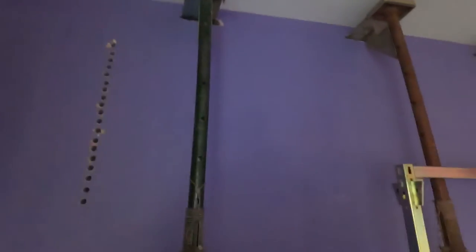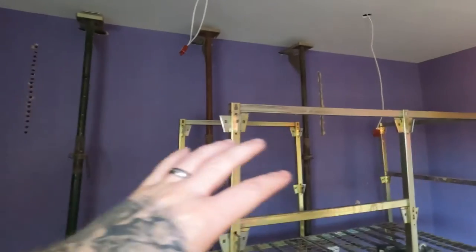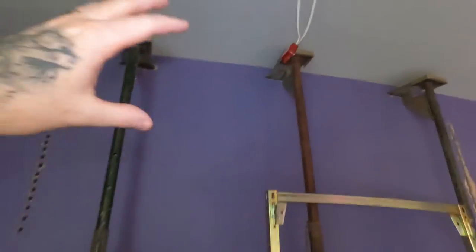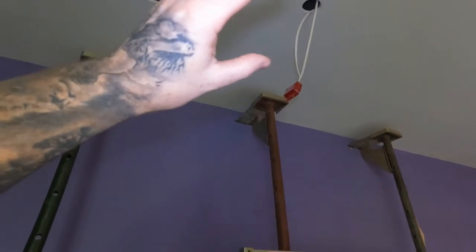The fastest way to know if your wall is load-bearing or not is to assess the area you're working in. Check above to see if the floor or roof above is bearing on that wall. The floor joists might all be sitting on that one wall, which means yes, it is load-bearing — you don't want to take that wall out because the floor above will start falling down.